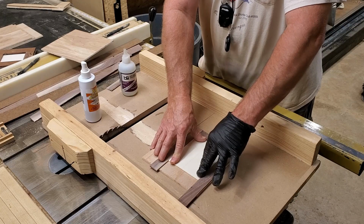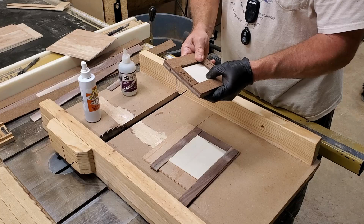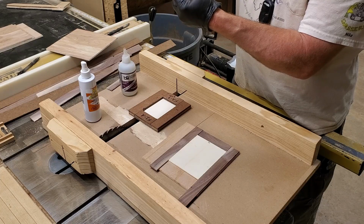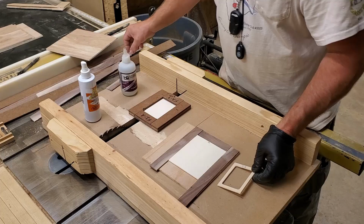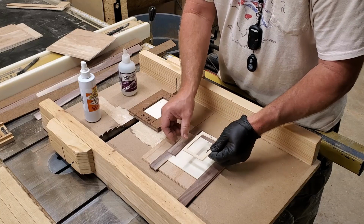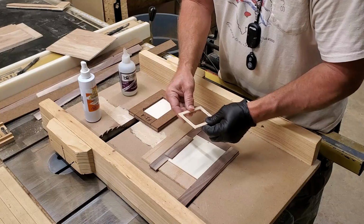All right, so now we need our top guide pieces. And this is where we need to make a decision. So here is a former, this happens to be F3 out of another plane. We need to decide how wide we want the part to be, or how thick we want the part to be ultimately, because that determines how far in we bring our bearing guide, if that makes sense. So, this piece looks like about 7/16, but it doesn't really matter as long as we make it uniform all the way around. And I think for this large former, I'm going to pull it in probably about that far.